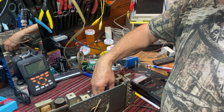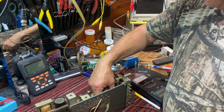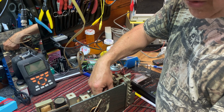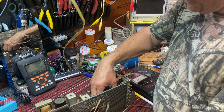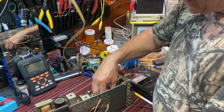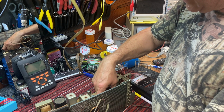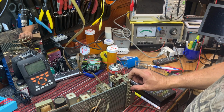I mean, it's the middle of the day, well, it's 6 o'clock in the summer, and so some of these bands aren't going to pull anything in, with an indoor antenna anyway. And that's what we should be getting on all of the bands, honestly. So the quiet bands are probably the switch. And it could be alignment. There's alignment on every one of the bands.